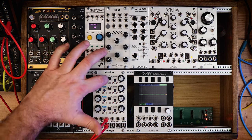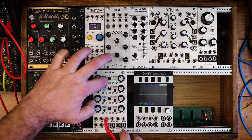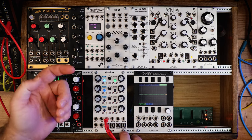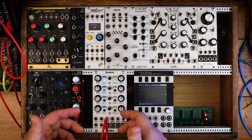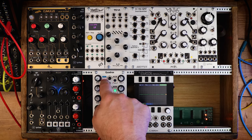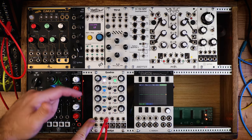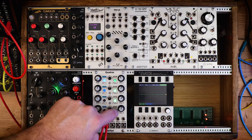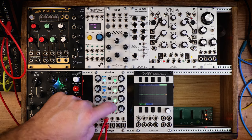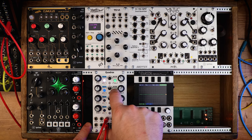So how you do that is you have these four modulation inputs. If you hold down whichever lane you want, it'll blink in magenta. I already have these programmed in. You can choose which CV you want. So I'm going to choose A because I want this input to affect any of these parameters. And you can choose how much to. It's almost like a built-in attenuator.